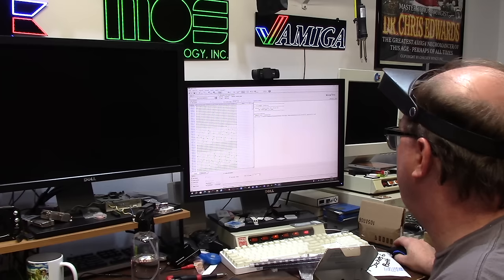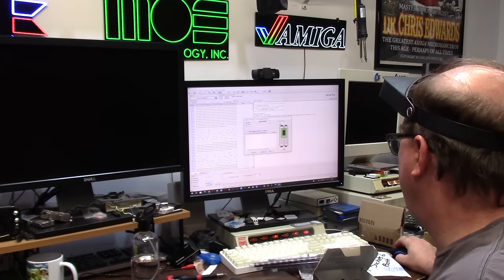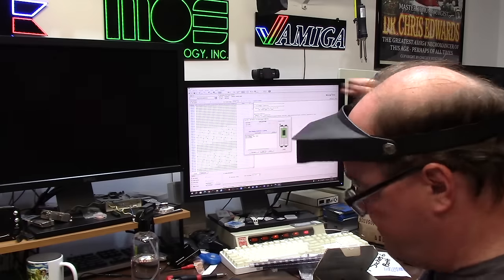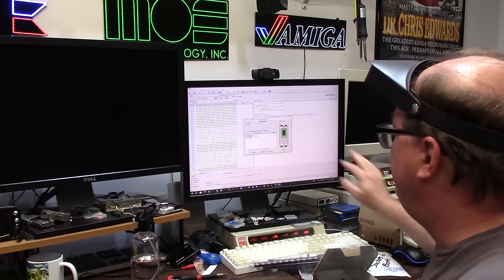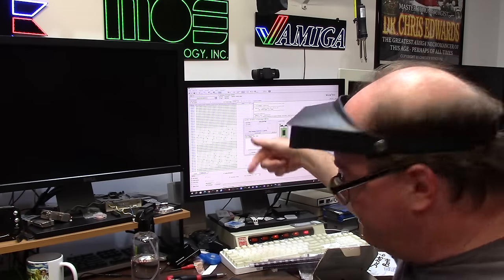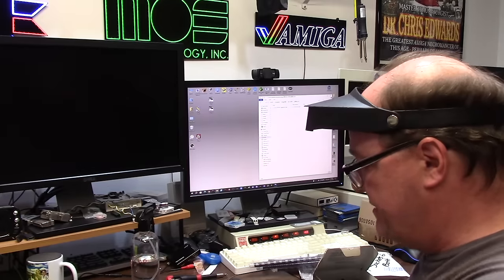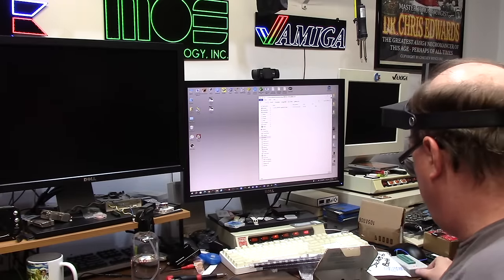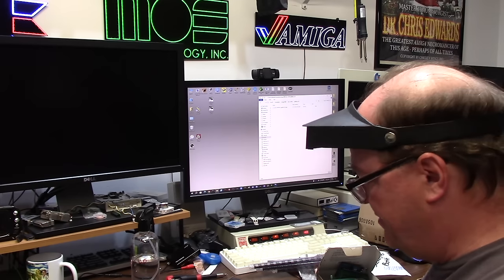212. Okay, now I'm gonna hit verify. That chip is good. Verify successful. That can go right back in. Nothing wrong with it. It perfectly matched. The other one, DOA. I'm gonna take both of those. I'm gonna peel the sticker off of this and put it on the replacement chip.